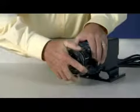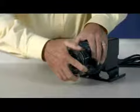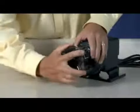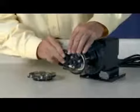The roller assembly needs to be collapsed to remove the tube. Hold the feed rate control securely. Use the tube housing cover as a wrench and quickly snap — rotate the cover counter-clockwise to collapse the roller assembly. The tube will no longer be pressed against the tube housing wall. Remove and discard the pump tube.